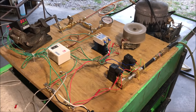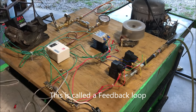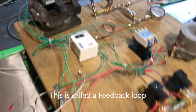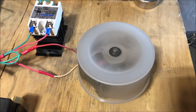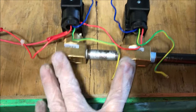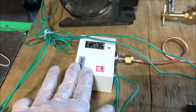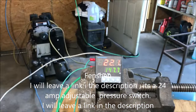What we have here is a breadboard layout of our control components that are going inside the boiler. I needed to lay everything out like this to calibrate the system and determine whether or not the hardware is up to par. Essentially we have two solenoid valves connected to the propane burner. This valve here is connected to the Fenson pressure switch, and this solenoid valve is connected to the solid-state relay that is run by the PID temperature controller.